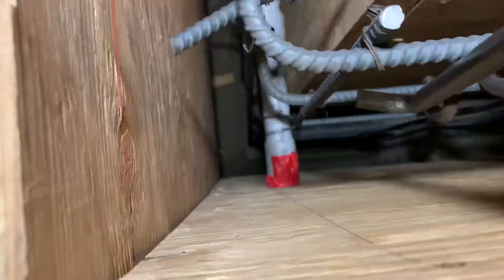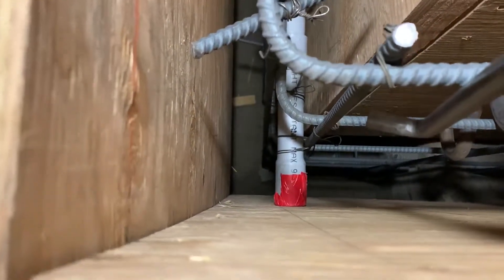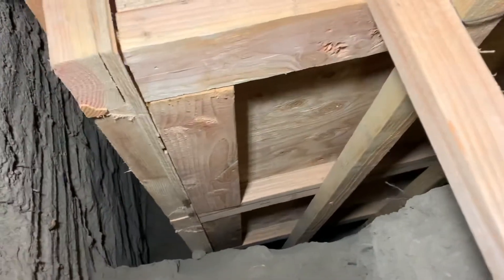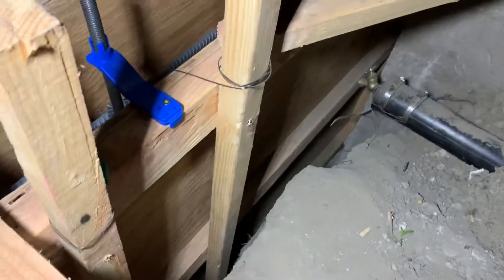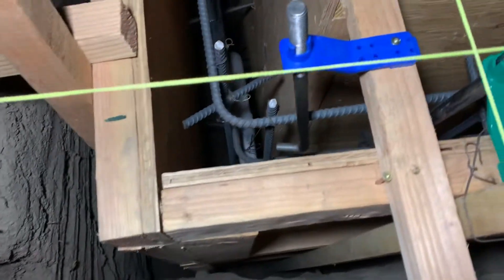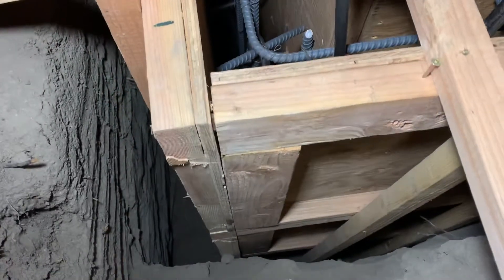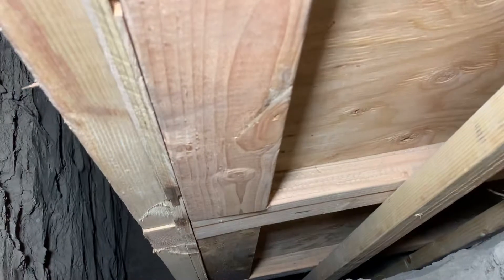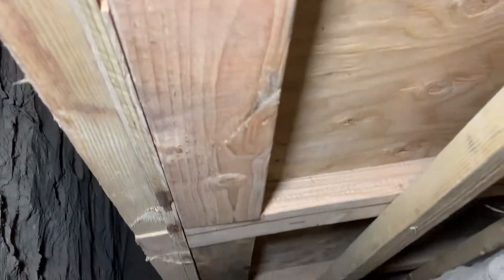You can see down there — I take my bell end. In some cases you would drill the hole through the form and stub out the conduit, but judging from how much room we have, obviously after we pour this wall we're gonna have to remove all this wood and pry it back. I also ended up being right on the two-by-four with my mark, so I would have had to drill a pretty big hole through all that wood and stub it out.